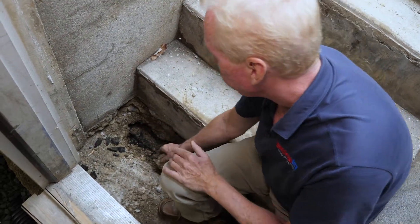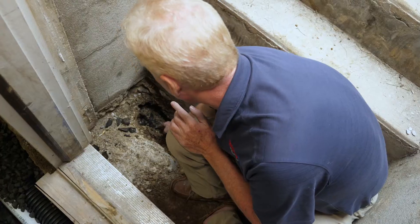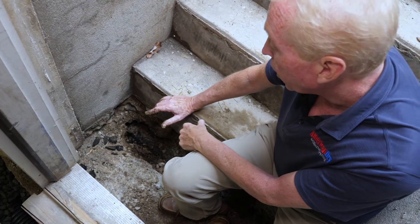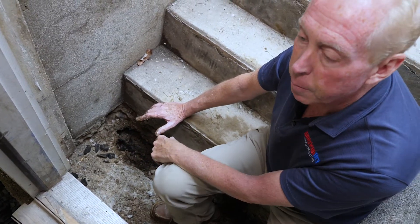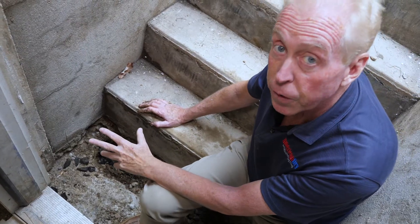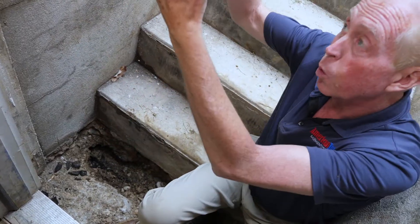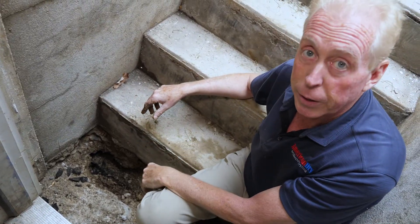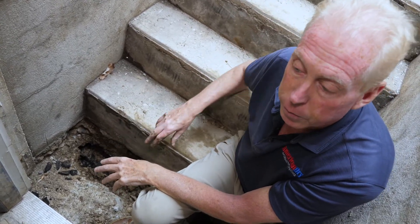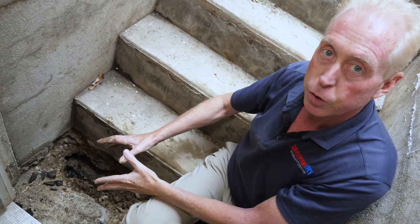As far as the placement of the outdoor footing drains — this is your footing here, this is the wall of the footing, and the pipe is right over next to where the footing is and then basically buried. There's a little bit of stone around this, but nothing like what you'd really want. Depending on when your house was built, stone became much more important. They used filter paper, but filter by definition is something that needs to be changed. As water migrates down through the backfill soil, the filter paper gets clogged, and since it's down there, the only way to ever change it is to re-excavate — which you're never going to do. So outside footing drains have a limited lifespan, and you also need your lot perfectly set up to run those drains to daylight.